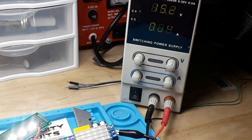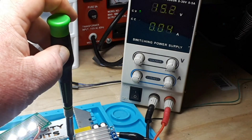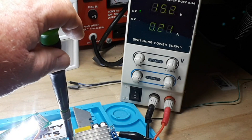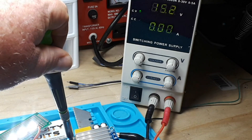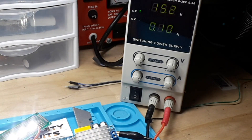It's well and truly hooked up. We are at 15.2 volts going in and 40 milliamps coming out. I can adjust the current right here with a screwdriver — that's maxed out at 210 milliamps, and I can take it all the way down to where they won't even light. Let's set it right around 100 milliamps. So we're at 100 milliamps at 15.2 volts input.